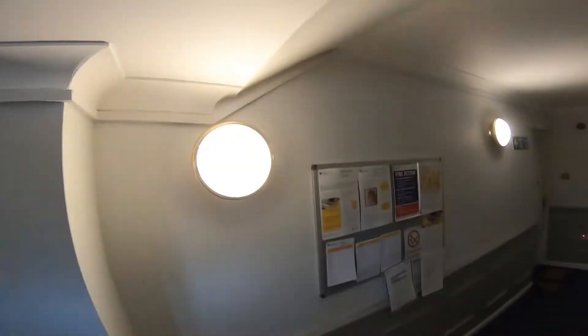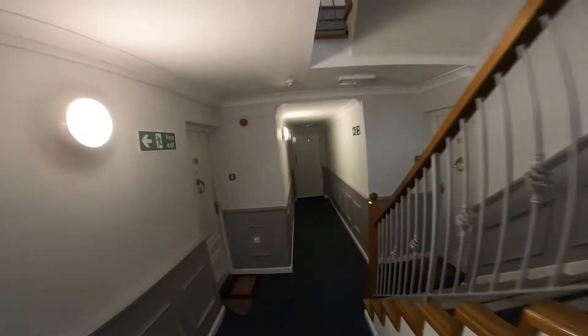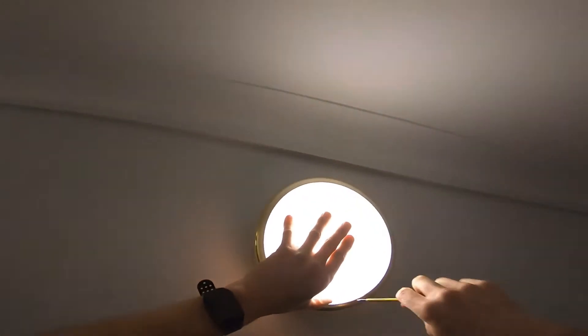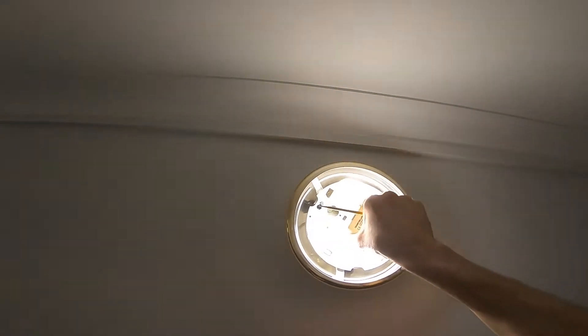I'm inside an old communal area. You can see straight away there's a light not working. The way these are activated is people come in, they press the retractive switch and that brings them on for about three minutes. Obviously this one's not quite right. Push the top in — it's actually starting working again now. Change the lamp, take that clip out and roll off the lamp.